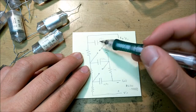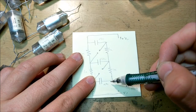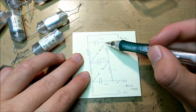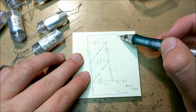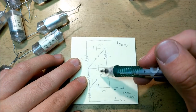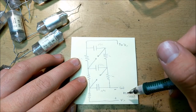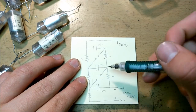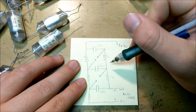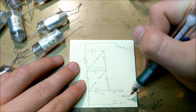in between the capacitors, it's all going to short together. And so this capacitor is going to discharge through the spark gap into this capacitor, and it's going to zigzag its way up here until the output voltage point. Now the cool thing about this is it's basically putting the voltages from all three of these capacitors in series. And so what that's doing is it's charging these capacitors in parallel and discharging them in series, and that is going to generate a voltage that's a multiple of the amount of capacitors times the input voltage.